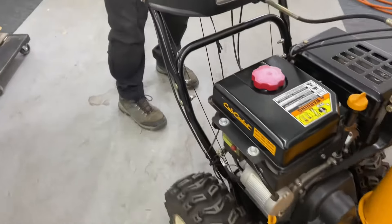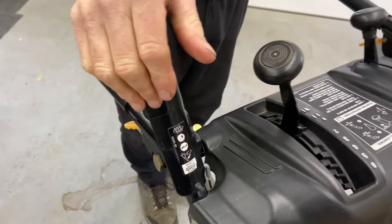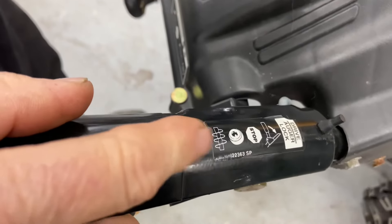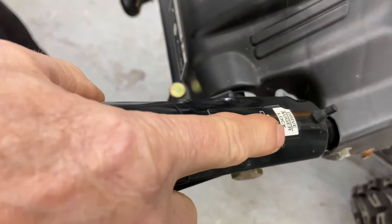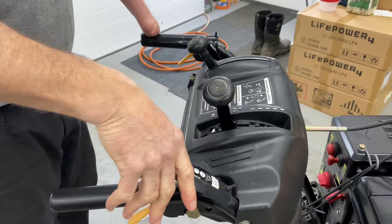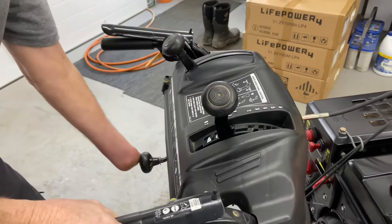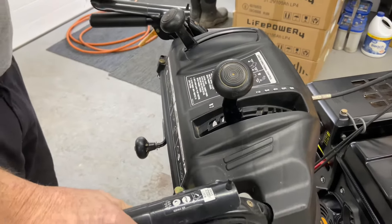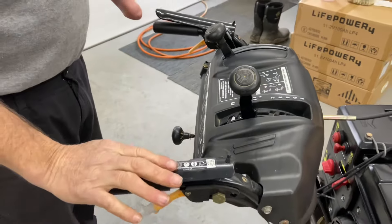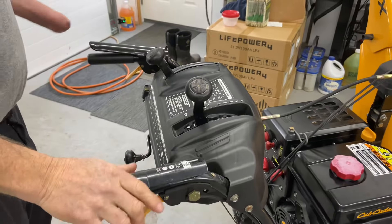Let's go ahead and show you some of the controls. On the back side here, you have handles for your traction control and handles for your auger control. It's a little confusing because it says 'drive auger lock' — people think this is your auger control, but this is actually your drive. What they mean by auger lock is when you put down your auger on this side and then put down your self-propelled drive, it'll actually lock your augers in the down position, which means you can control everything with your other hand. When you lift up on your transmission drive, it'll unlock your auger.